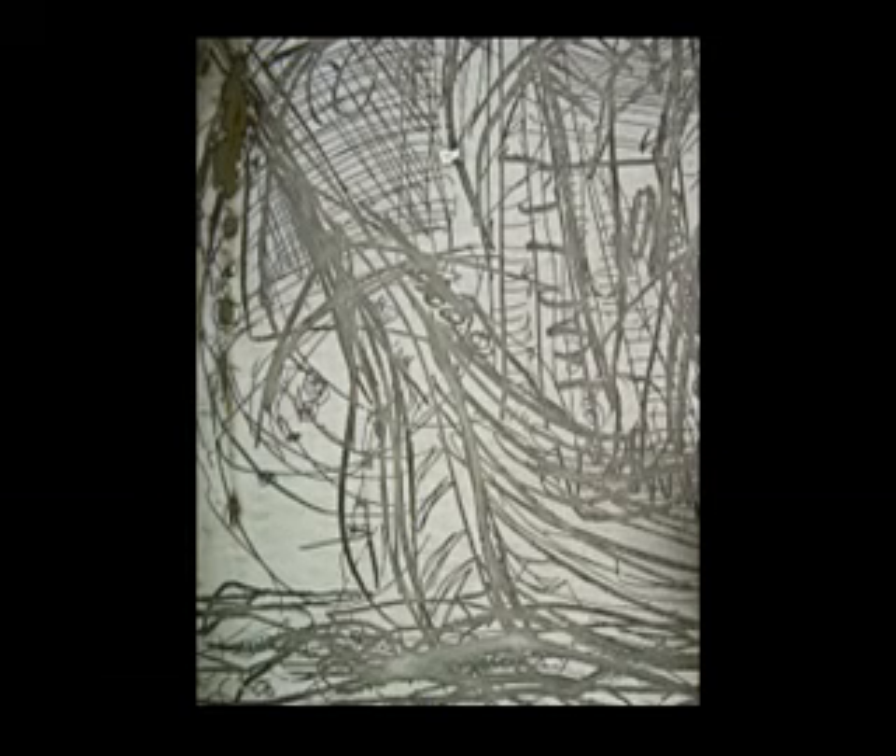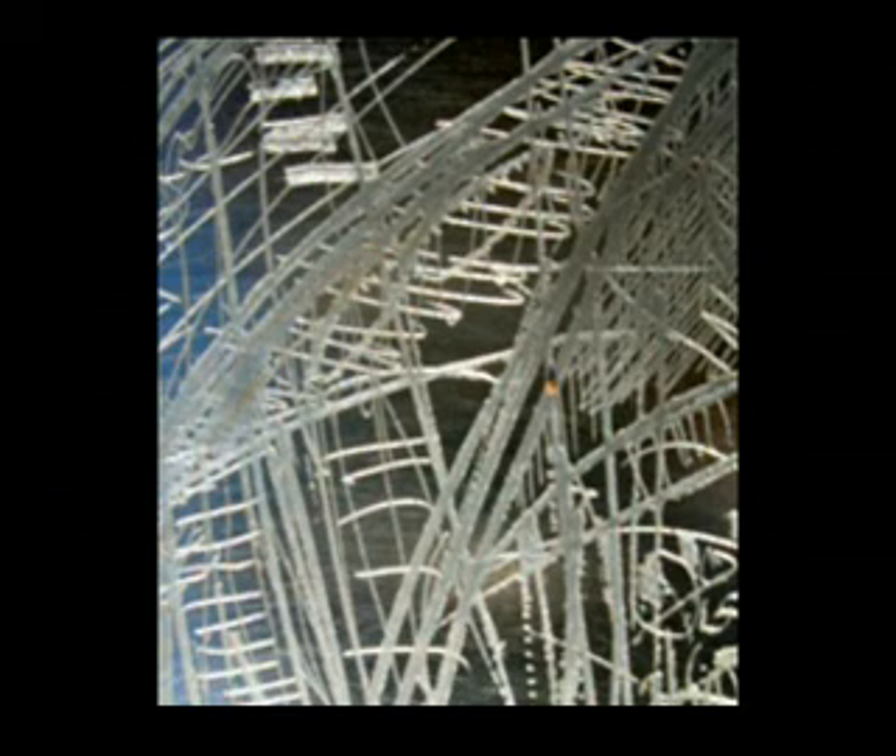This is the electrolytically etched plate. Now you have to protect this plate, because if not, the iron would rapidly oxidize in contact with the air. There you see the galvanized plate, which I protected by galvanizing the surface with zinc.